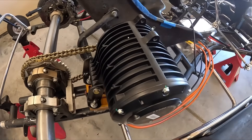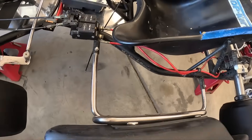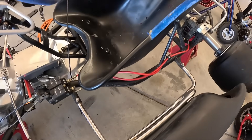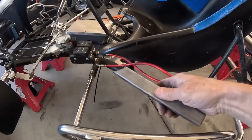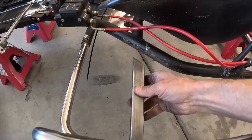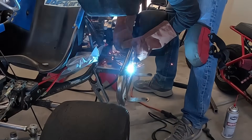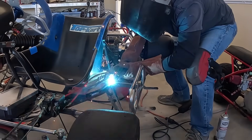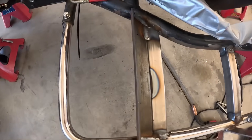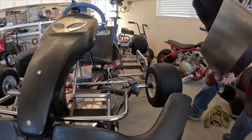With the motor mounted on this side, I think I'm gonna mount the battery over here on the opposite side. I was gonna mount it in the back, but with the battery mounted on this side it'll have more of an equal weight distribution. So I think I'm gonna weld up a piece of metal here and then one back here to create a battery box. That turned out pretty sweet — I put a piece of angle there in the front so the battery doesn't slide forward. Let me pop that battery in there and see if it fits.